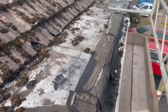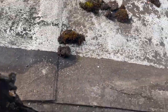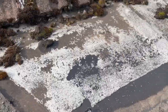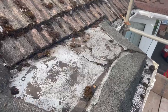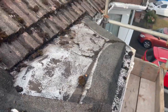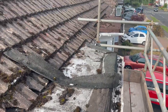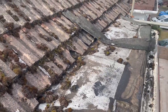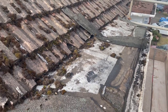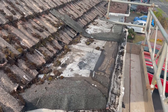This is the small bay I'm going to be replacing today. As you can see, it's hanging off the drip edge, has come away. It's seen its day — a couple of broken tails here as well where it meets the little bay. So I'm going to be stripping all of this off, reboarding it with OSB. I'm hoping the existing board decking is sound, and then I'm going to be covering it with EPDM single-piece rubber membrane. First job is obviously to strip it all out.